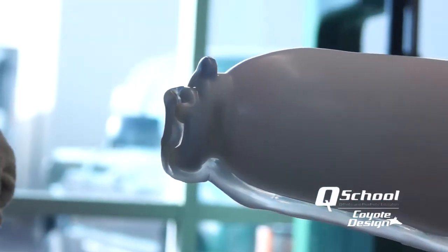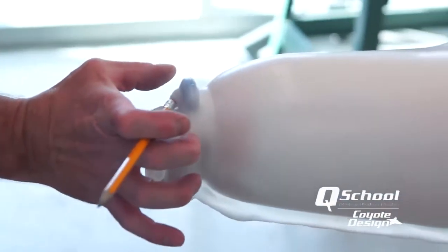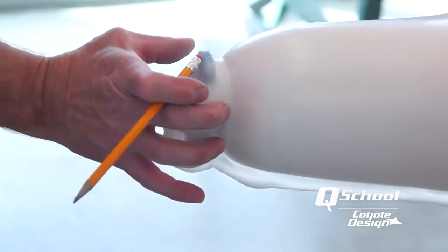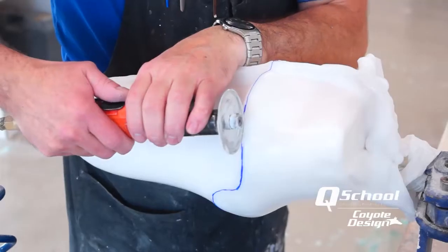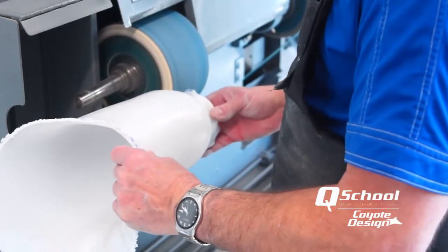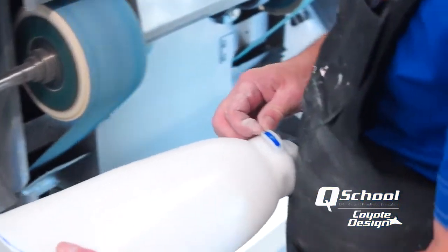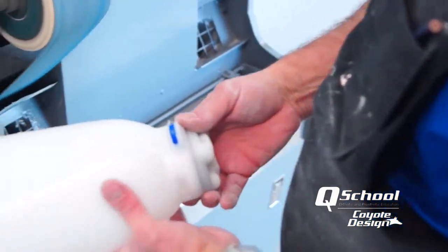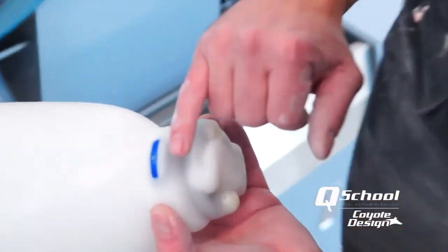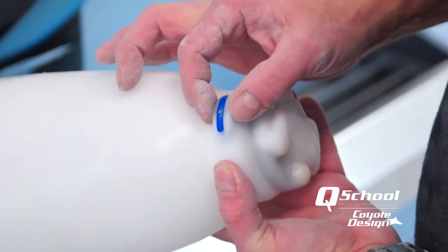We'll trim off our excess and push down over the end of our Alignable 4 and try to fill that up with plastic. You have a really nice draw here — you can see how the plastic just bites right into the grooves that are cut into our lanyard puck. That's exactly what you want it to do. It locks that in place so it's never going to rotate or move on you, keeping your alignment and keeping everything safe. We'll cut this out, knock it off, sand open our exit hole for our lanyard strap. Grind down to our tooling piece for the exit hole — just grind until you see the complete face of it. You don't want to leave any plastic over it.